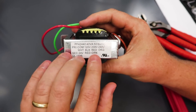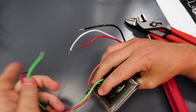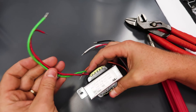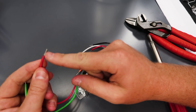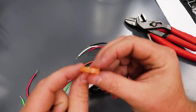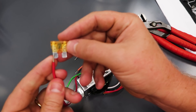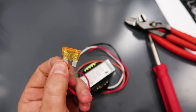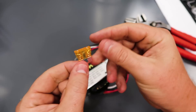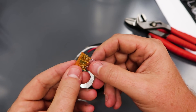On the secondary there is no fuse in this transformer. Some transformers come with fuses built in; this one does not. If you don't have a fuse in the secondary anywhere else, you need to put one in. You typically use a little 5-amp fuse — sometimes a 3-amp — and you install it in-line on the hot leg using a spade connector, then connect the other side out to the R terminal on your air handler or furnace. Make sure connections are good, insulated all the way, with no exposed wire.